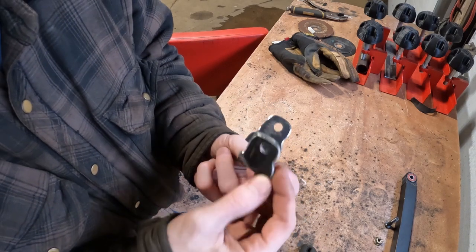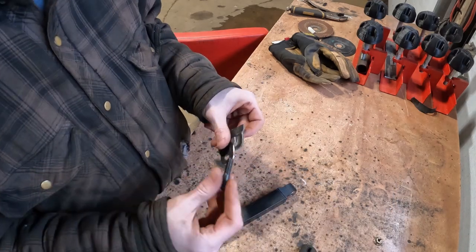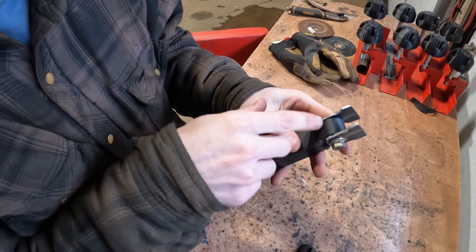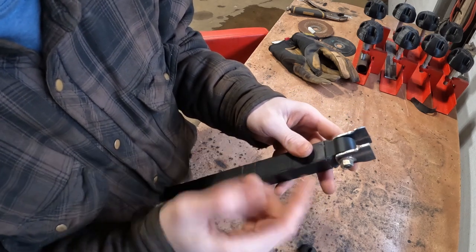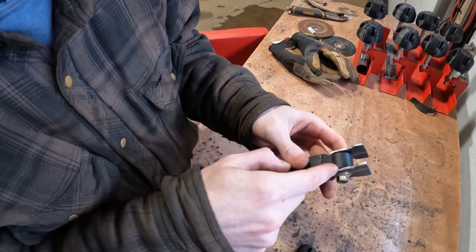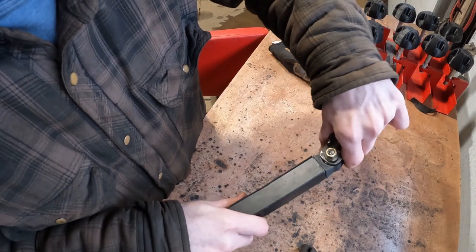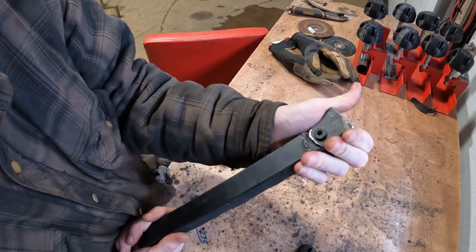So I got a little bit of cleaning done on these and it's time to try them out. I'm going to have to put some spacers in there, and luckily skate wheels usually have spacers in them. Since these are skate bearings, I'm just going to take the washers that came out of the wheels and slap them in here, and we'll get that full bearing motion again. But for now it's a little jammy, so now we can copy these brackets.